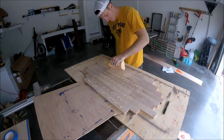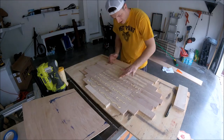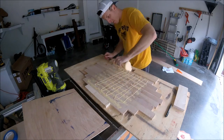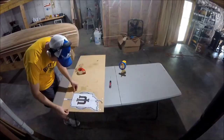I laid down some glue, but then realized I needed a means to squeeze the boards together, so I nailed some blocks to provide clamping pressure from side to side. I spread the glue out with my custom glue applicator and then realized I could probably use a little bit more. Finally, I laid down my backer plywood board and found some heavy stuff to clamp it down.